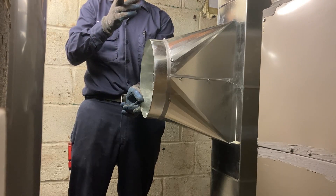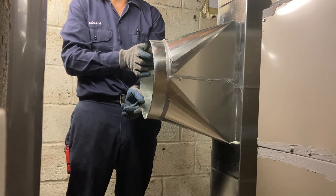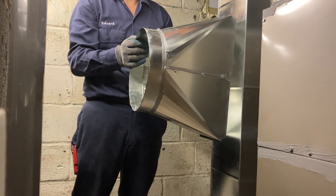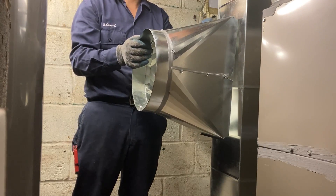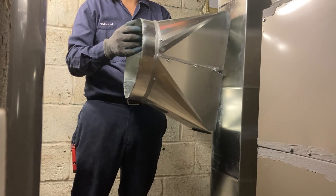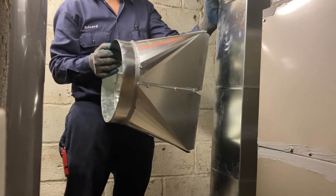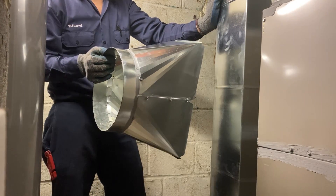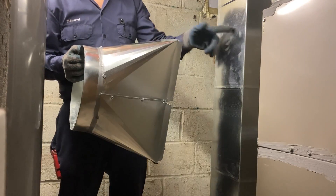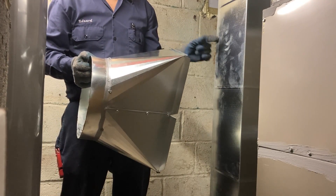We still have to come about an inch and a half towards here to be able to meet the pipe up there. You can always make a flange and screw that in, but the idea is it has to be removable in the future because of the water heater — they need to be able to remove the ductwork and remove the water heater if needed. In this particular job, we don't have room, there is no other place to put the furnace, and we have to do it. So today we're going to learn how to do that on ductwork with sleeves when you don't have a place to just add a collar on it.